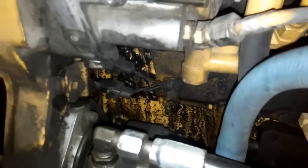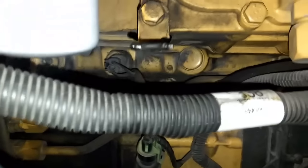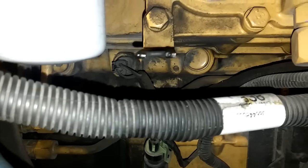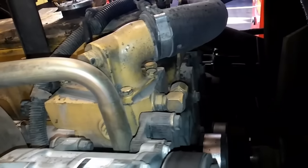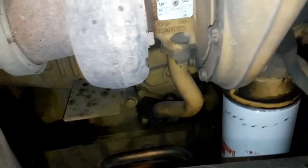Into your front structure above the power steering pump — some of these engines are going to have air compressors. You can see your serpentine belt, and there's also a small V-belt there. Your coolant temp sensor is right there behind the HEUI pump under your fuel filter. Now on to the exhaust side of the engine: we have your thermostat housing — it uses two thermostats. You can see your exhaust manifold behind your intake tubes, your turbocharger, oil return line, oil cooler, oil filter, and another oil leak — looks like the rear structure is leaking between the block and the rear structure. And that's your walk-around.